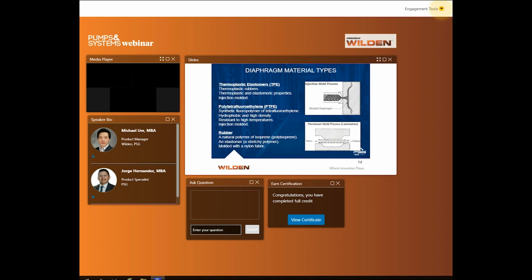Here we're going to take a look at diaphragm material types. So by this point, you've heard me say TPE, PTFE, and rubber. So what are those? Is there a difference? Yes, they are different. The TPEs are a class of polymers or a physical mix of polymers, usually plastic and rubber, a plastic and rubber mixture. These are injection molded diaphragms. They provide a longer life due to the lack of fabric, because both are bonded at the molecular level. So there's no need for a fabric to hold and strengthen the diaphragm. So you'll get no delamination, you'll get excellent flex life, and great chemical abrasion resistance.